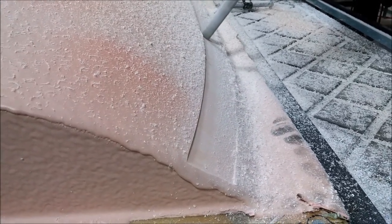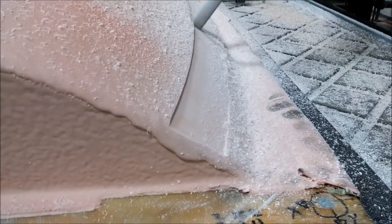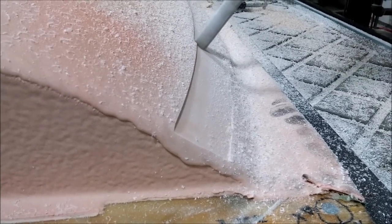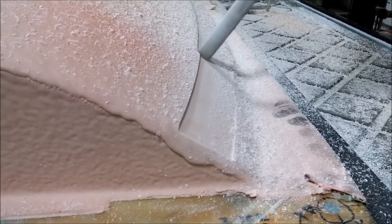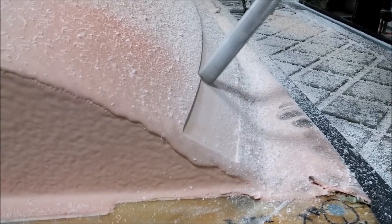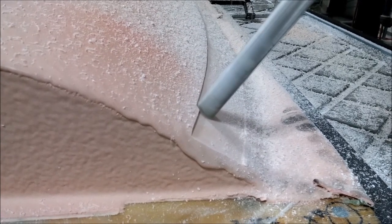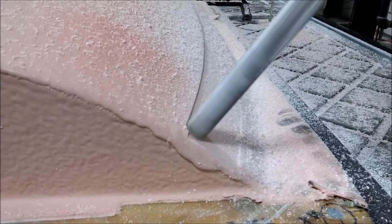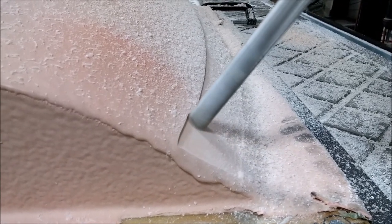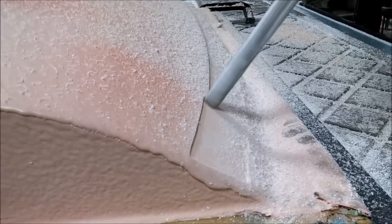As you can see, we are now milling some of the plugs that have the putty on them. This first one is the upper door outside fascia above the windows on the main doors. We're just milling off a little bit of the putty — about 1/16th of an inch, maybe a little more — and leaving the finished surface. That one is now being finished and Jeff's got it sanded and ready for primer.